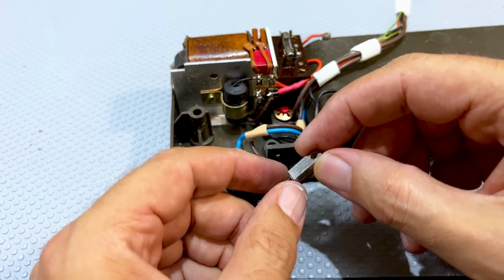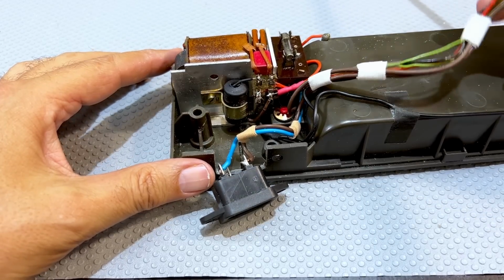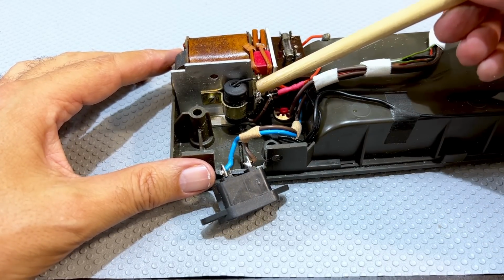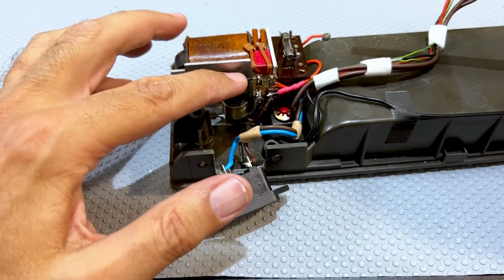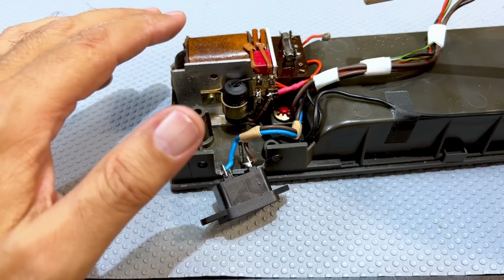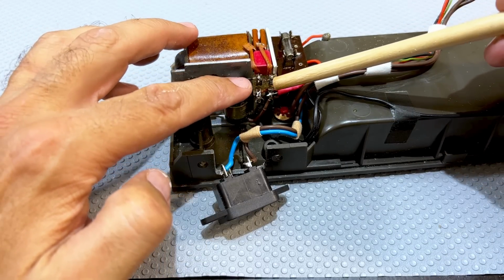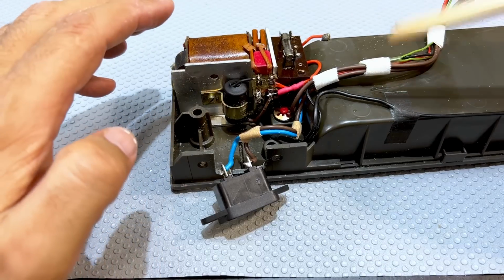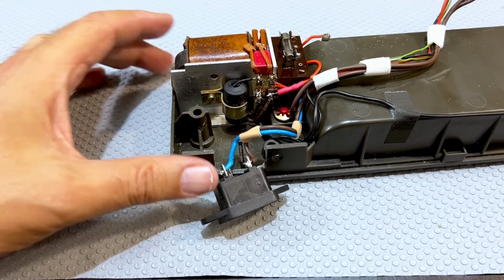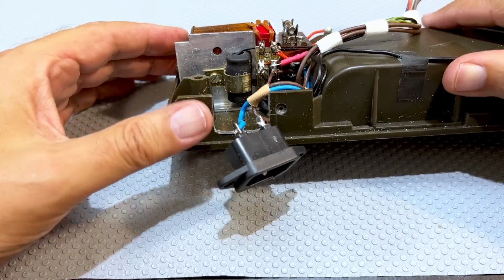So I checked the voltage, and guess what? They had connected the line that goes to the radio, that orange one or red one, to the capacitor there. Now, the positive of the capacitor is actually the first regulated voltage from the rectifier. So I measured 13 volts. This thing's supposed to produce about 7.5, 7.6. This thing was sending 13 volts to the radio. So not surprising, things were a little bit strange there. Anyway, I replaced the capacitor, the transistor, and I wired everything up again.